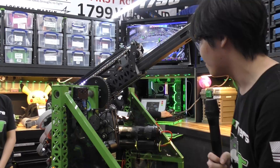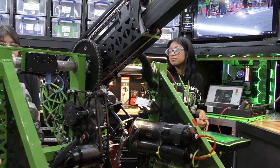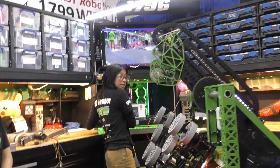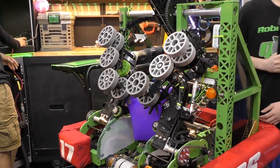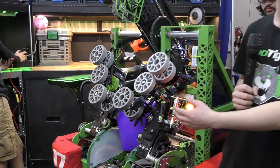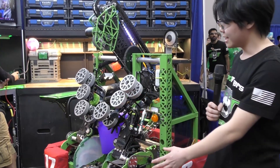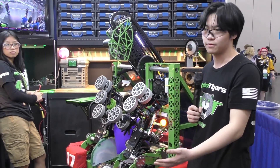In addition to that, another custom thing we have inside the robot is this Limelight camera right over here. What this allows us to do is detect which game piece is inside the robot and what its position is. So if you want to go back to home, we can demonstrate it through intaking. As you can see, the arm closed whenever the Limelight detected that the cube was inside the robot. We created a custom pipeline for the Limelight and we're able to determine where the cube is based on the camera's vision. So if it detects that it's right over here, it'll grab it based on how close or far it is from the inside.